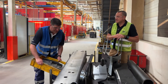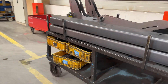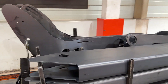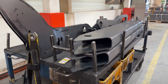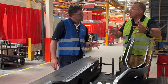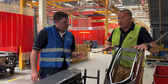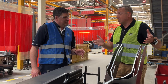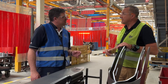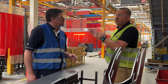When we've got the bento box, we slot it into a carriage designed for the manufacturing process. All workers stay at their station — it is the right quantity of components required for a specific model for a specific sub-assembly coming through the station for sub-assembly welding. This cart here is for a skid steer loader arm — could be a small model like the S100 — and these are the components to build the arms of that future customer's machine.